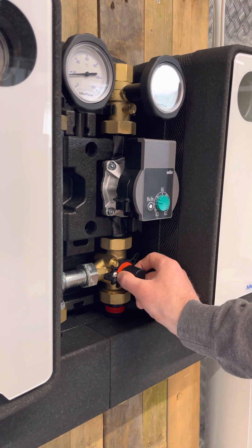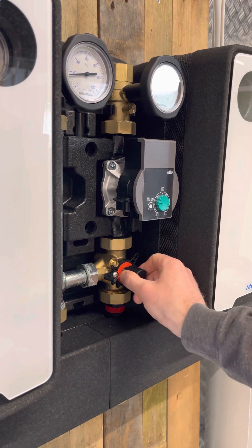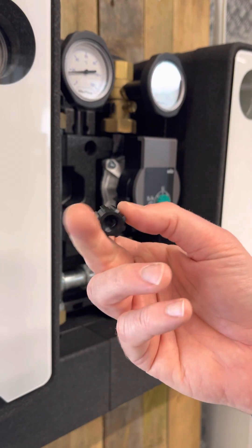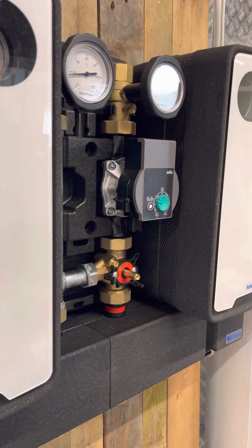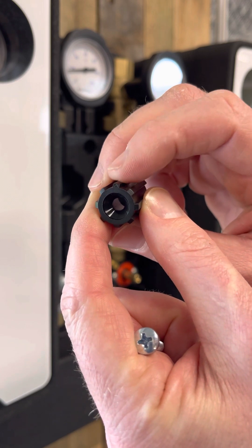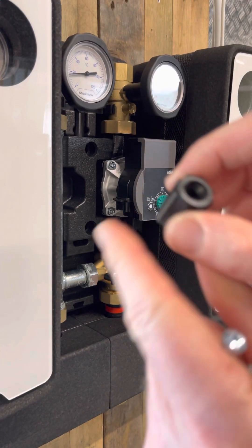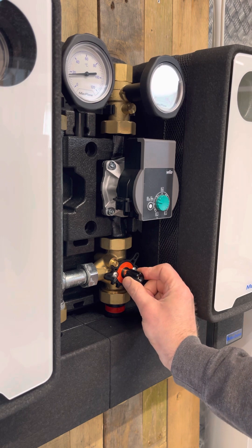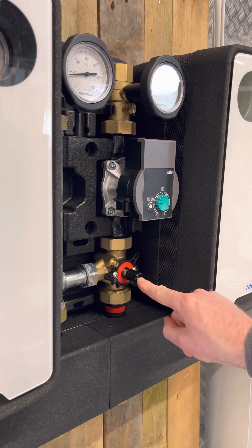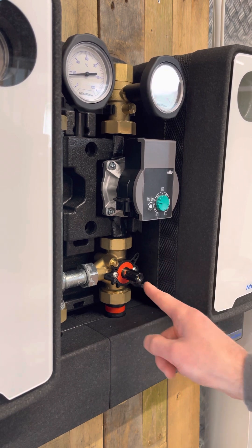If we remove the manual control knob while it's in the down position, inside the pack you've got a mixing valve adapter for the head. That adapter goes on one of the splines - there's a little arrow on that spline, and that arrow needs to be in the same orientation as the arrow on the manual mixing valve. Put that arrow to the bottom and it should slide on, with the brass of the valve just visible through the adapter.